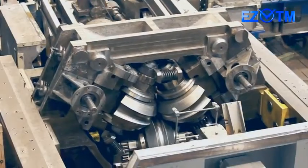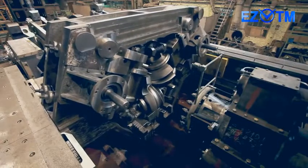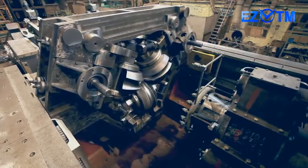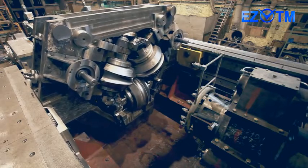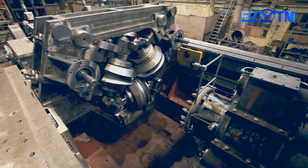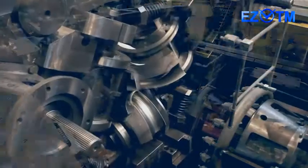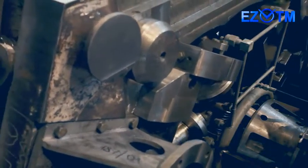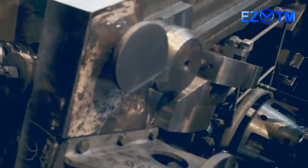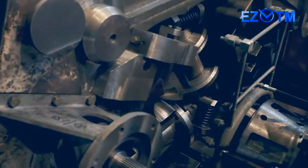The accepted 3-high rolling stand scheme, mutually mobile power housing and roll cassette, has high rigidity and can endure massive rolling forces beyond the capacity of any other mill in the world. Rolling with 3 rolls minimizes metal sticking on a tool, which is especially important for rolling of stainless steel, improves the quality of finished tubes, and enhances the durability of dies and mandrel.